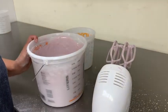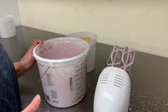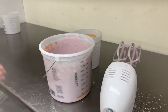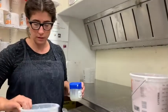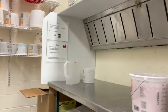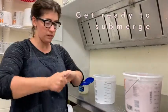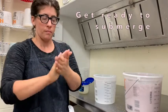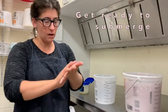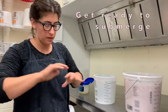I'm going to spin off a little bit of alginate from the mixer and set it down. Alginate is much easier to clean after it's been set, so I'll just leave that mess accumulating — trust me. I've got my original alginate bucket with a little dust in it, so I'll tap that out. There's nothing else to do to prep the bucket. I'm going to take a little bit of Vaseline and rub it on my hands — just a little release sometimes makes things better.